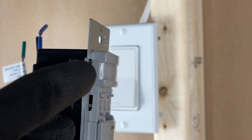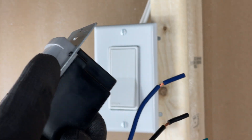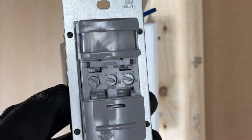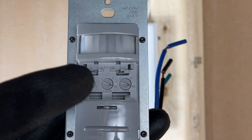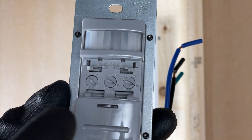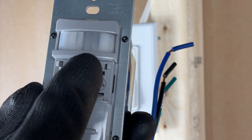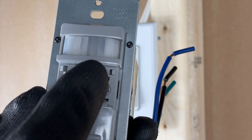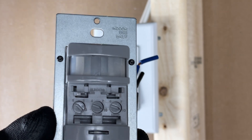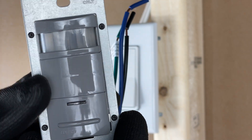Today, I want to show you how to swap out a standard switch for an occupancy sensor. This is a 180 degree occupancy sensor, so it catches all the way from one side to the other. It's got some cool features inside — time to stay on, a range of pickup and light level, and it's also got blinders. You can blind a portion of the window and lower it from 180 degrees to something else. So I'm going to swap this out. Let's get to it.